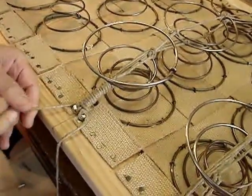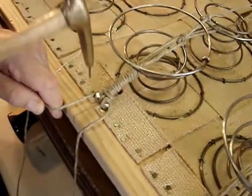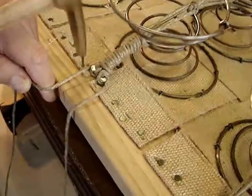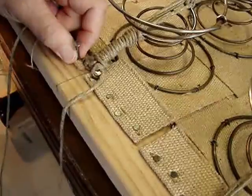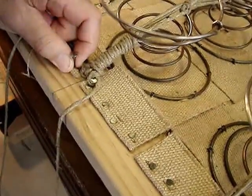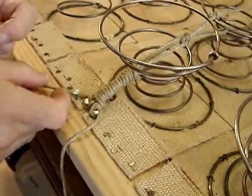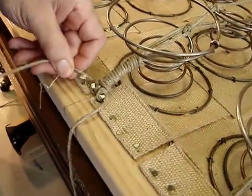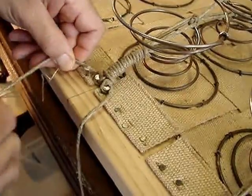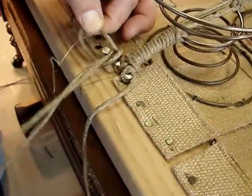This protects it and minimizes that risk. Now we're going to put a tack. I'm going to place that tack right there. See, that's why it's difficult to do it with these nails because you have to get so much downward pressure. On some pieces, you might want to pilot your tack hole or nail hole with a drill bit, just so that you don't split substrate.